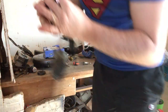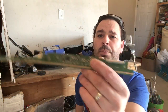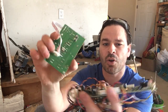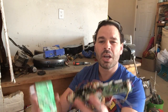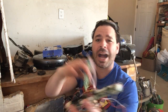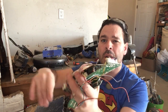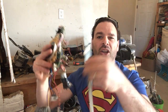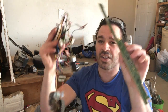Your circuit boards have different categories depending on where you are. Some scrapyards will give you low grade, medium grade, or high grade for your circuit boards depending on the types of precious metals on them. If it had gold — here is a circuit board I just pulled out of a monitor, notice the gold on this — this would be a high grade board, paid more for the precious metal. These three you see, with a small trace of silver, you're probably going to get mid grade, about seven to eight cents a pound. The scrapyards I go to only give me one category for all e-waste, about five to six cents a pound. If there are precious metals on it like this monitor board, I'll hold onto it and look at online sources like boardsort.com — there are places online that will buy these at a higher value.